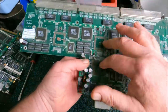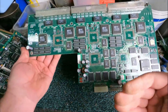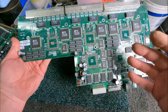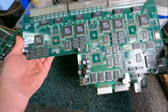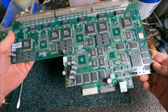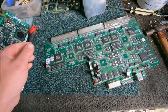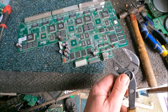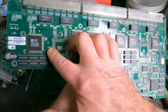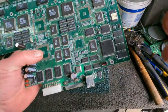Now we've removed the five BGAs and brought this down to server grade. This would no longer go as telecom grade because obviously we've taken off the chips, but it's still a really good server grade board. In this case I could even probably pinch a couple of other things. I'd probably take one of the flat packs. When you want to take one off, you look for the best kind possible - this one here is the IBM PowerPC chip, like a CPU pretty much, so the chances are this one would have the best gold recovery.